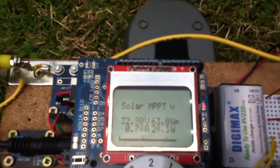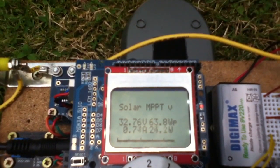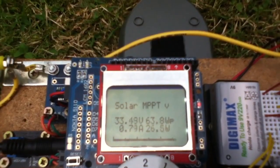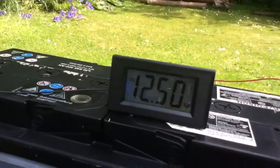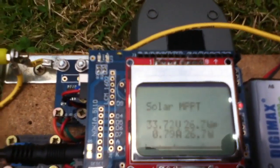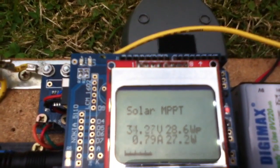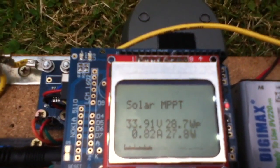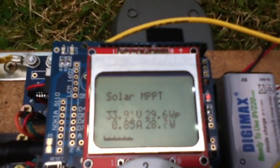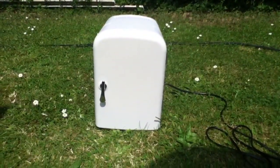That's about the maximum - it is slightly overcast so we're not getting full power from these two panels, which should be able to give 40 watts. We're pushing 25 to 28 watts peak, flickering between bar graph densities because I've got the trigger point at 27 volts. I need to put some hysteresis on that to stop it happening. About 29 watts is going into the battery, but with the fridge drawing 40 watts, we're still draining the battery.